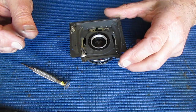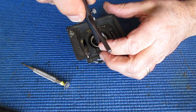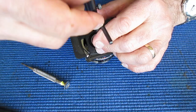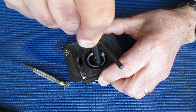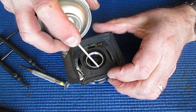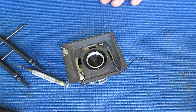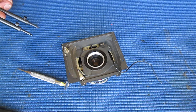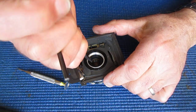The retaining ring may or may not come without a fight — we shall see. If it gives any resistance I'll add a few drops of solvent to soften up any oil, lacquer, or anything that might be sticking it. That's a bit stiff. A few drops of cleaner — let that run round the thread and soak in for a second to see if it helps. Back to the tools — a spanner wrench with interchangeable tips; relatively cheap, I think it came from India, but it works well for a task like this.